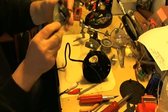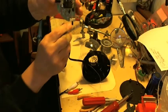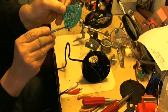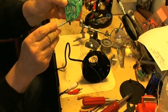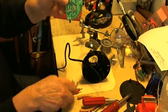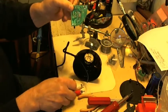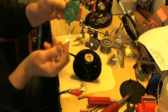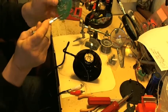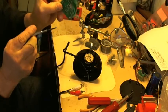And there's then the other end of that transistor, under that end of that transistor goes to a land. It's this land right here. I hope you can see that. And there's two holes. I only need one. And I will connect the hot lead of the red cable, the hot lead would be the center one, to one of those lands, and I'll connect the other one to the ground plane that I created earlier. There's a hole there for the ground plane. You can either make one big hole or two small holes. Your choice on how you want to do that.